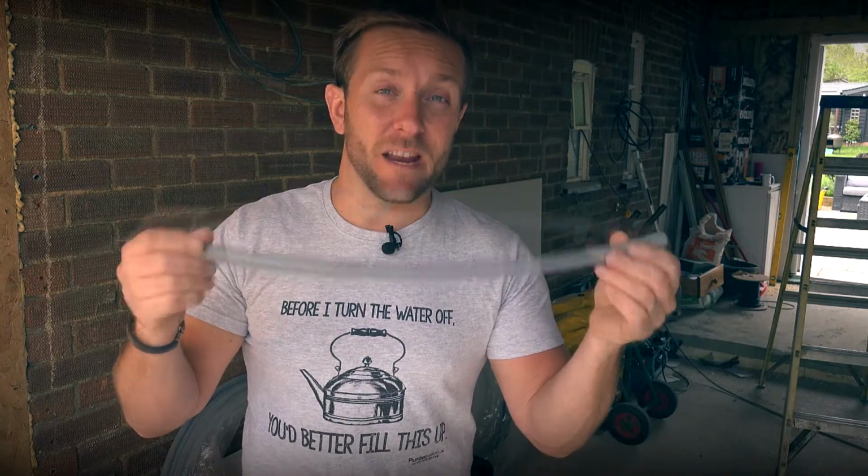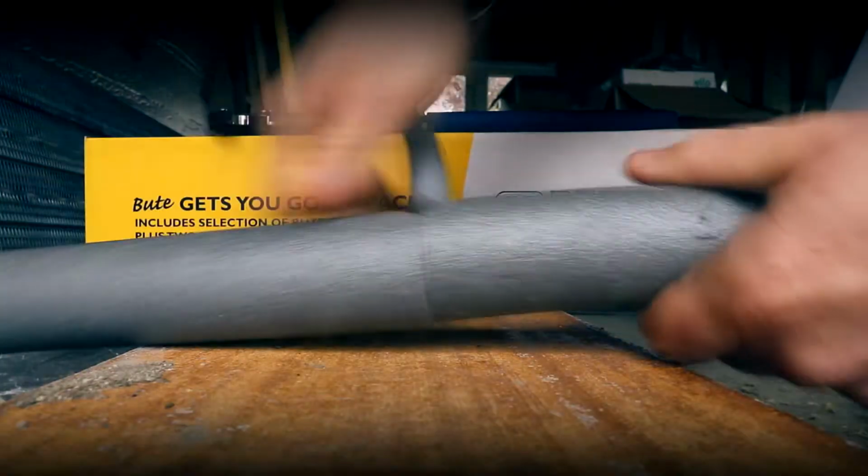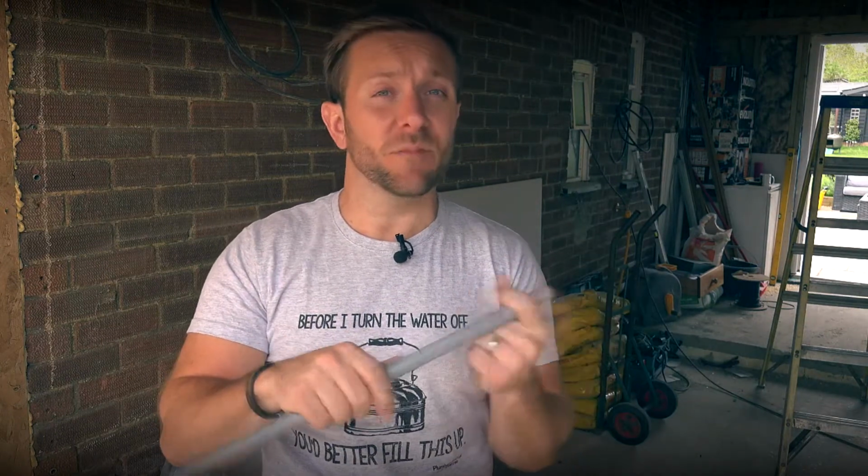You might remember back in the day, there were problems with non-barrier pipe, basically letting air into the water system, building up sludge because obviously you've got air and water together, causing problems like that. Because there's a barrier in this, that stops that from happening. Any hot water pipes or cold water pipes that you put through, always put insulation on anyway. That's another major advantage for this. The actual fittings you can insulate really easily, 100% within the requirements that the UK have for plastic barrier pipe to be used on hot and cold potable water systems and also on heating systems as well.